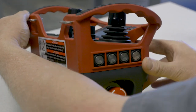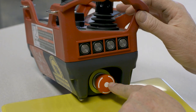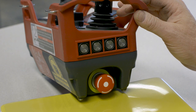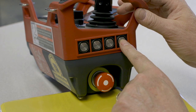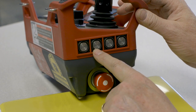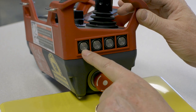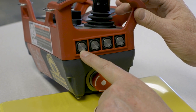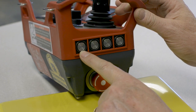On the other end of the remote, we see the e-stop button. Push in for power off or to go to e-stop; twist and pop out for e-stop release. We have throttle plus, truck engine RPM plus, and truck engine RPM minus. This RPM switch is not used in North America with PTO-driven machines — it would be engine start on a European machine. Engine kill is a safety function: if something is happening on the pump and we need everything to stop, we simply push this button and the engine will be killed.